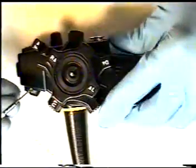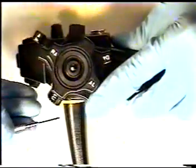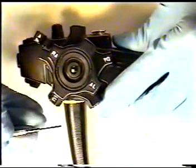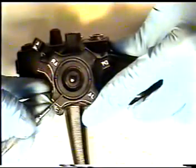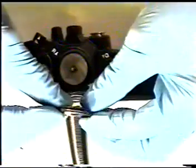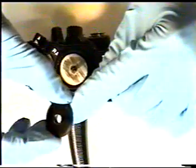Next step is to pry out the left-right knob airtight cap with either a small number 1 or 2 screwdriver, tweezers, or dull knife blade. Be careful not to damage the O-ring inside or the knob itself. This part, when reinstalled, will have the groove on the top. Underneath it is flat. The indented groove will be on top. Put this with the other parts in sequence.